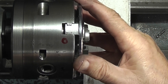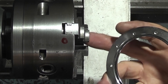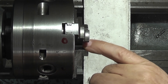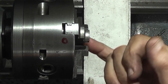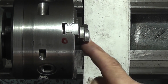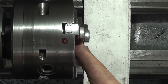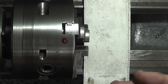Now with this ring method on the outside, I've had people say no, you're not loading the jaws properly, it won't be as good as using the jaws to grip. I've seen people using bits of metal between the edges of the jaws, gripping on the 45-degree of the jaws, but I'm wondering how accurate those jaws are machined at 45 degrees. They may not be accurate — all they're there for is clearance so that you can actually close the jaw. If that's not accurate on the 45-degree machining, you could be gripping one jaw slightly further open than the other and every time you put a piece of work in the chuck you've already got a built-in run out.